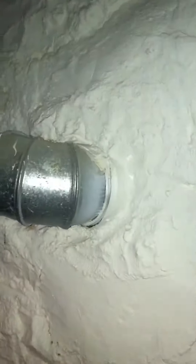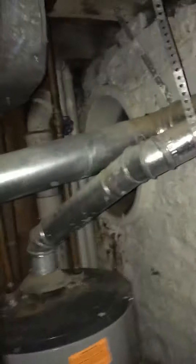As far as that return drop is concerned, it's a little bit of a pain to get to. It's kind of drywalled on the backside and then we have a water heater as well. I'm not sure if there's a liner down the chimney — I can't see a UL rating. That's our UL sticker. There's evidence of a sleeve so I'm going to have a look outside and see if we can see a cap from the outside. The water heater's on there as well.